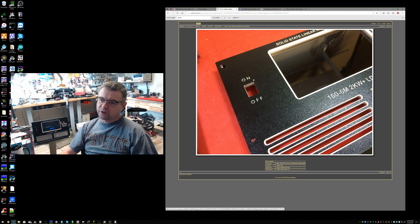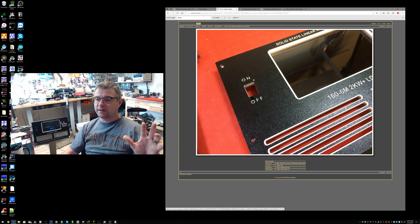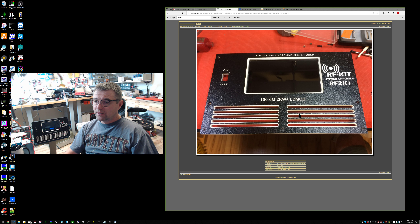I drilled and tapped the front plastic panel and used a Sharpie to blacken the white area. A note on the power switch: Tim actually designed the front panel to just have you put the power switch on the outside of the front panel. I didn't know that. What I did was machine out the area just underneath using a square bit on a drill press and put the power switch underneath the W4YN front panel. I like it — functionally it's very tight, and if I decide to remove the W4YN panel, the switch stays in place as originally intended on the aluminum faceplate.